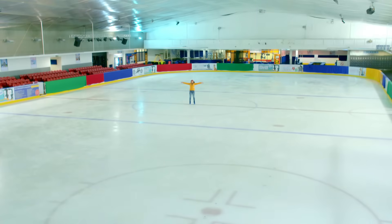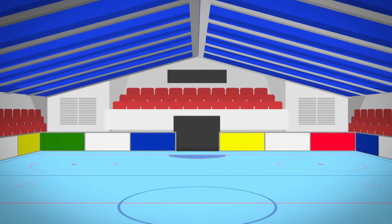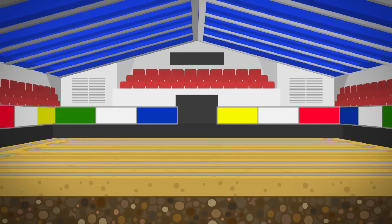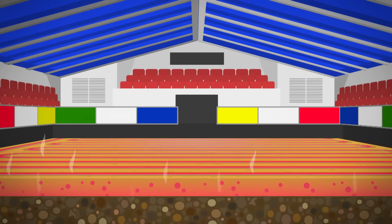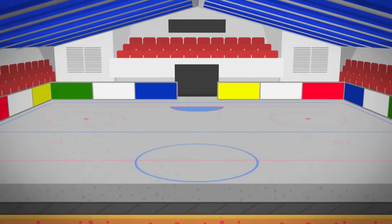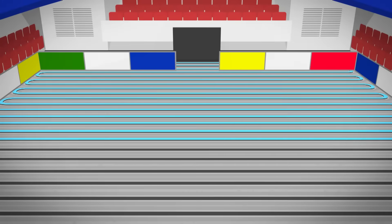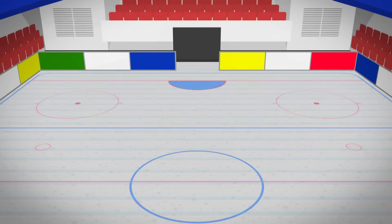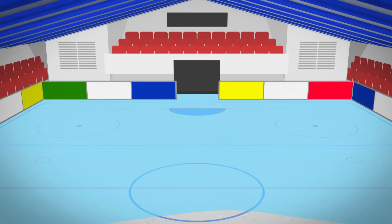But how do you freeze something as big as this? Well, the answer lies beneath the ice. An ice rink is made of lots of layers of different materials. The first layer is made of small stones pressed tightly together to make a hard base. Next comes a deep layer of sand that has heating pipes inside — the heat stops the ground underneath from freezing and cracking. Next, a layer of insulation keeps the warmth from the pipes down in the ground and the cold up in the ice. On top of this is a layer of concrete that has miles and miles of pipes inside. A machine called a chiller pumps a special liquid called glycol — which does not freeze — through the pipes under the rink. The special liquid is very, very cold, so the concrete gets colder and colder, and when water is put on top it freezes and goes from runny liquid water to a solid ice rink.